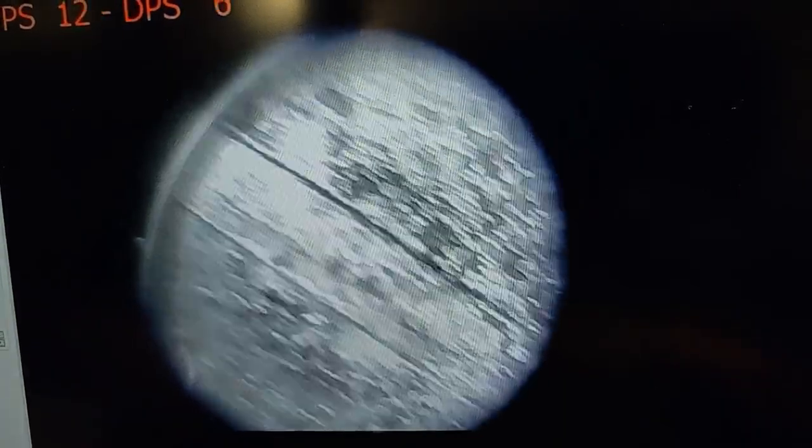So let me kill some of the light. There we go. Pretty heavy corrosion on the crown. So this will probably need some touch-up if we want to squeeze some consistency out of the barrel. I'm not saying it won't shoot, but just one of those things I like to look at. But look at this bore. This looks pretty bad. Again, this does not mean it's unsafe. It's just heavily pitted. There's some cotton patch from us cleaning. Yeah, the corrosion goes down pretty far.